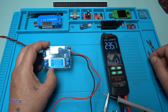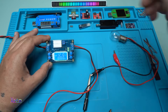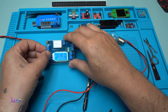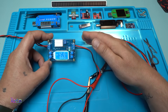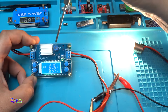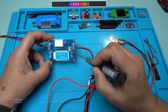My multimeter is set on auto — 3.4, 3.4, I like it. Here I have a car bulb, this one is 12 volts and is pulling around 1.7 amperes. I changed the input voltage to 15 volts, the output voltage is set on 12 volts. Let's power up the bulb — it's pulling 1.65 amperes. You can adjust the current using this potentiometer. Yes, you can go down to one amp and you can see that the constant current LED turns on.